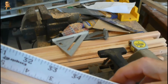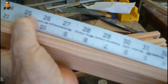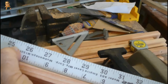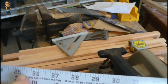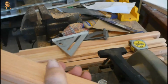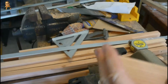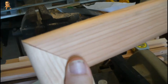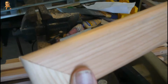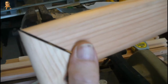Now, when I made the cut on the 25, which is 1 inch down, it actually came out 1/8 of an inch deeper. And if I had cut this 1/16 of an inch deeper, if I cut this smaller than the piece of the glass, what will happen is these pieces won't meet up. If I make one of these pieces bigger than the glass or smaller than the glass, I'll end up with a crack like that in between.